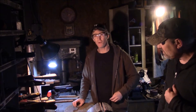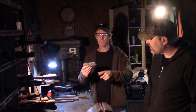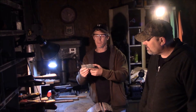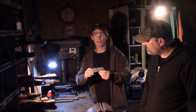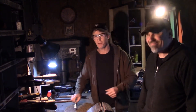Thanks Wayne. How are you doing tonight folks? So if you guys saw that billet draft, we got it out to about nine inches and about three-eighths of an inch thick, and then I cut it on an angle. There are two pieces in the forge already. I cut it on an angle so that when I come down I'm going to forge this up as the blade edge, and I'll squish this end down to draw out a tang. Maybe we'll just watch and see how it develops. Stay tuned folks.